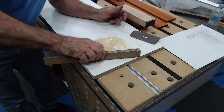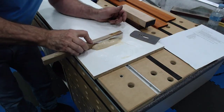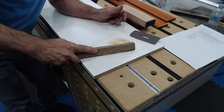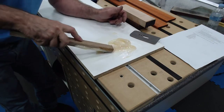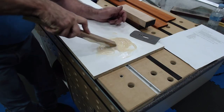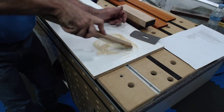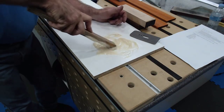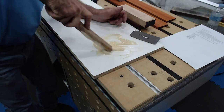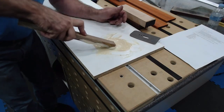The good thing about epoxy as a glue is that it takes a long time to go off, so you've got a whole lot of assembly time. But if you mix a lot of it up in one batch, it goes off really quickly. It gets very hot. It's the same as resins for resin tables and things like that, which everyone seems to think is flavor of the month. Everything's got to have a resin table or something. I haven't done it much. I've done it with my display for the hand planes for Turner, because I thought that'd be really swish.